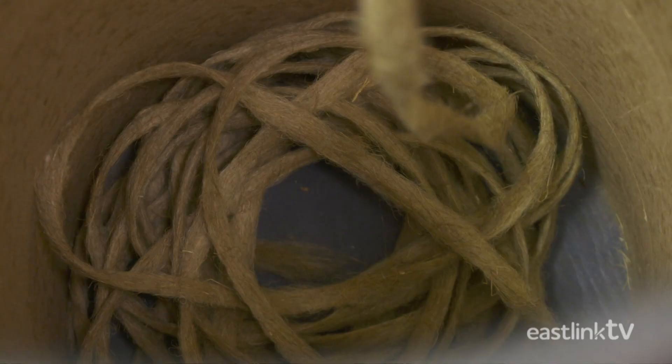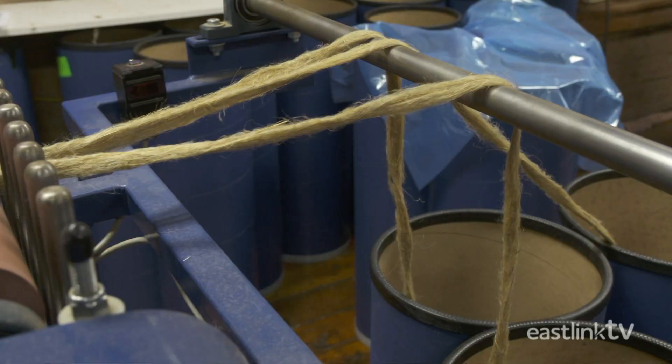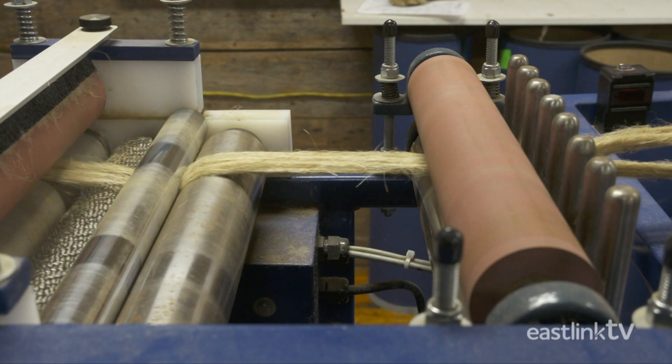Because this material is still too thick and uneven for spinning, the roving is threaded into the draw frame where it's drawn or pulled out further. It runs along a series of rollers and combed wheels and is then twisted.